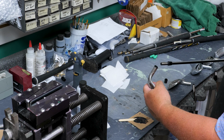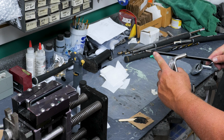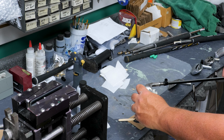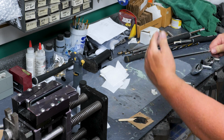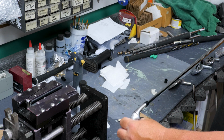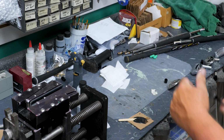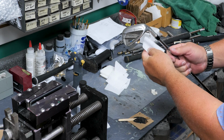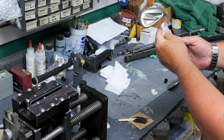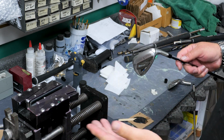And nice, it's all looking black on the inside, and it's all looking covered. Now, as you can see, there's a whole lot collecting at this particular area. And what can happen is if your ferrule is not very solid or seated very well, that epoxy can move it off, and that's what we're trying to stay away from. So when you seat it, you can hear the sound, and you can tell it goes from a tinging sound to a solid sound. And that's how we ensure that we have it seated.